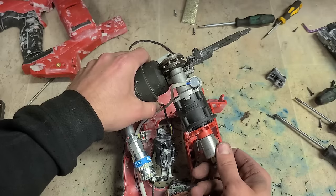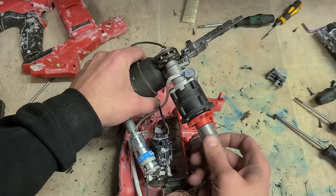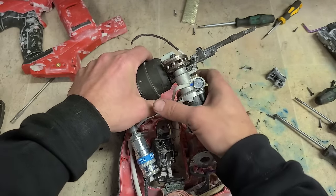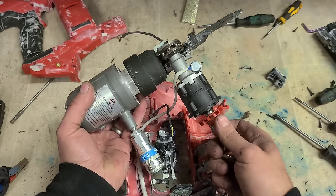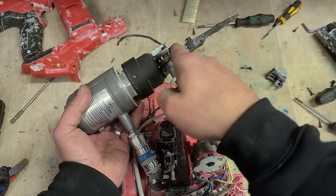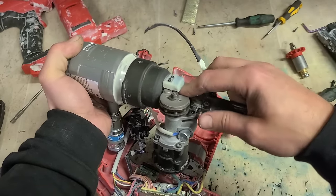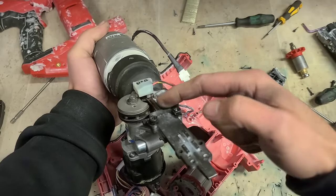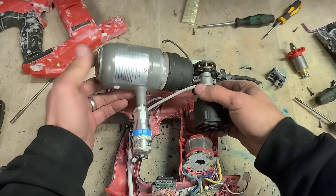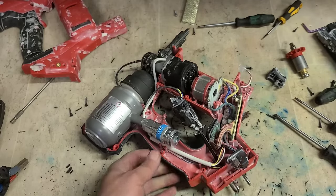See what I mean by working on Milwaukee guns - I just do not like it. So that's what your mechanism is doing - she's just rotating this and that only goes one way, can't go back. Because obviously you want this to actually back off whenever the pin is under full compression at the front of it. So we're going to wind that all the way around - three hundred and forty degrees - so this gap here is in line with the pin. So now whenever I put gas under this, that pin will actually come out. We'll see if we can get gas into it first before we even bother trying to fix that wire. Hook the airline up - see if we can get some pressure on. I'm going to put 90 PSI into this and see how it runs at that.